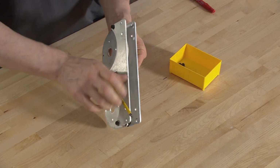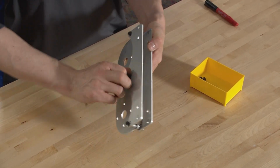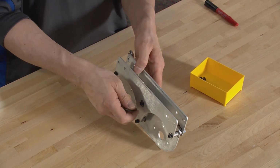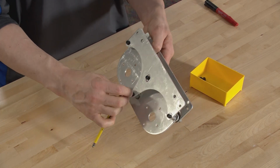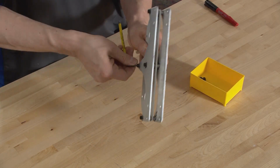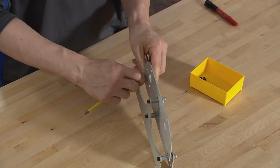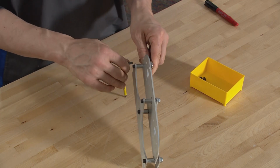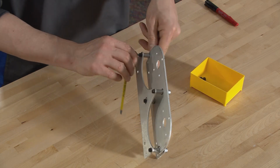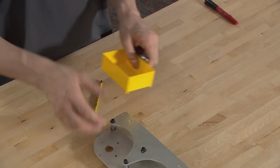And the idea is just if it's tightened all the way down, depending on the exact height of the spacers and stuff like that, it might not fit onto the 1 inch. Like this area, this gap inside here should be 1 inch. But if we tighten it down so much and the spacers were a little too small or we crushed the aluminum a little bit, it might not be 1 inch anymore. And then it won't fit on our 1 inch box that we're going to attach it to in the next step. So we get that and get this one close. But by getting them close to tightened up, it's going to help align things a little bit for us. And it's going to make it easier once we're in position to tighten it down the rest of the way. All right, that's pretty good.